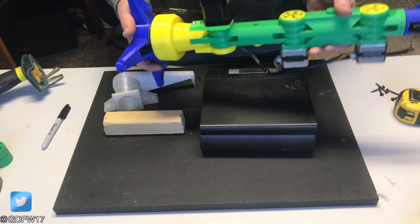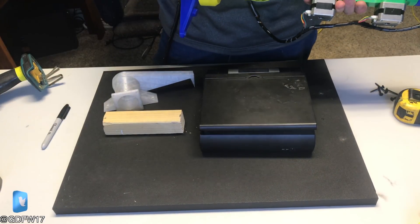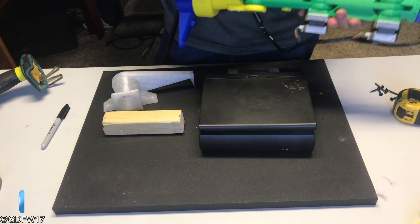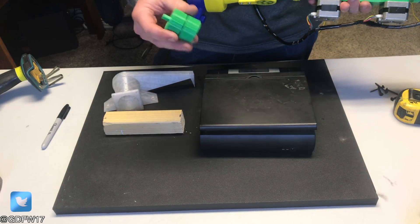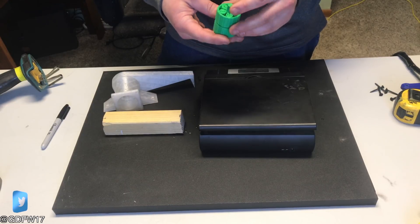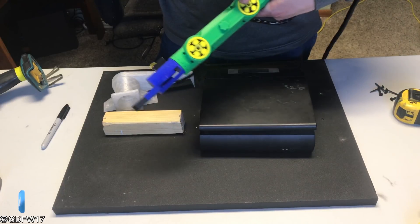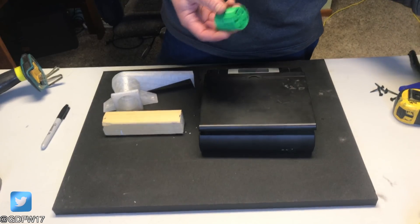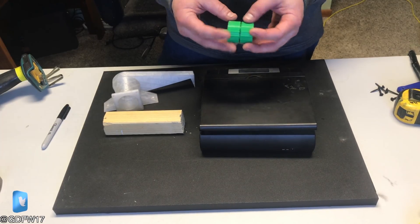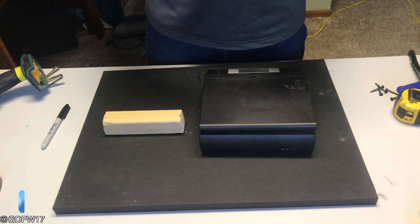Before I start actually doing this, I need to figure out how I can do it — if I can gear it down with compound planetaries, if they are efficient enough, and if they're strong enough to build a robot out of them. So today I'm going to test this compound planetary, which Ross Korski actually designed. I believe it's based off my 66.46-to-1 that I used in my previous robot. Today I'm going to test it and see if I can break it with a NEMA 23 motor.